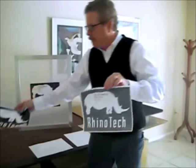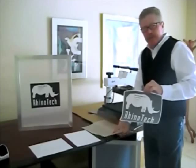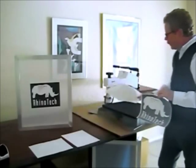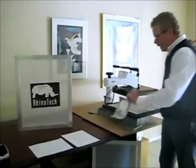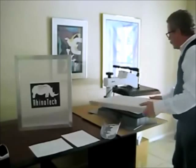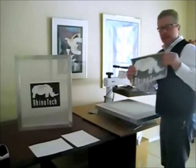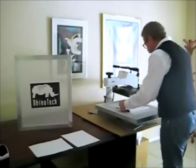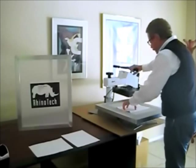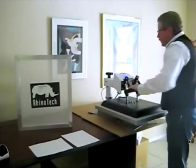That's obviously the adhesive. The next step is to actually put it onto the surface of that screen. What we're using again is going to be a heat press. We put down a release paper. That's to absorb any adhesive going through so that we don't get it down onto the bed. At that point, we take our screen, we can lay it right in here and straddle our bed, lay our stencil in position, and heat press that down for 25 seconds at 375 degrees.